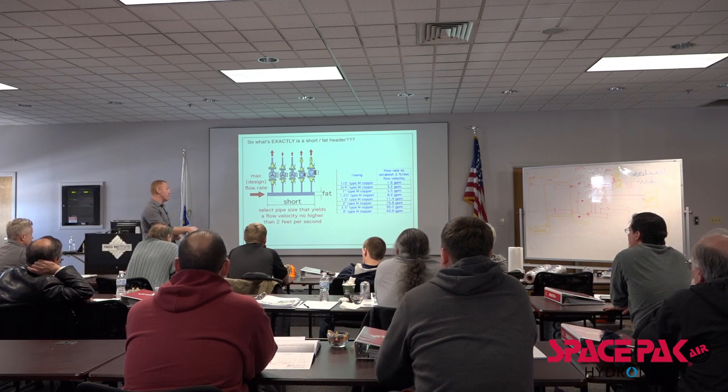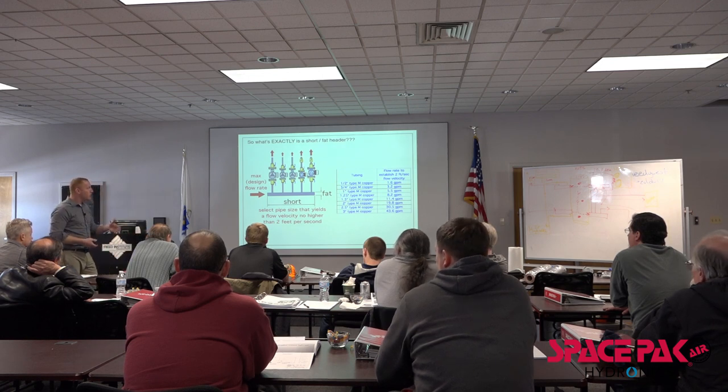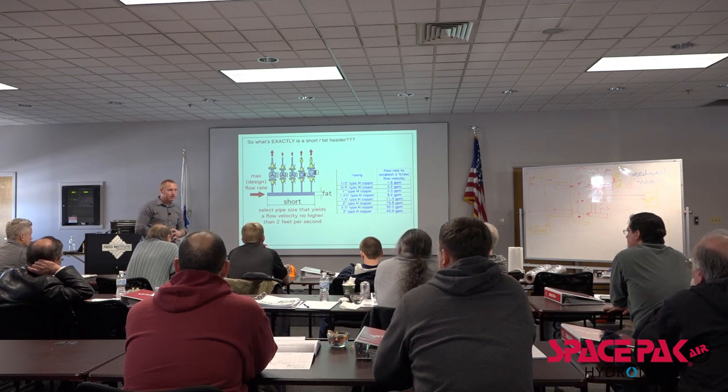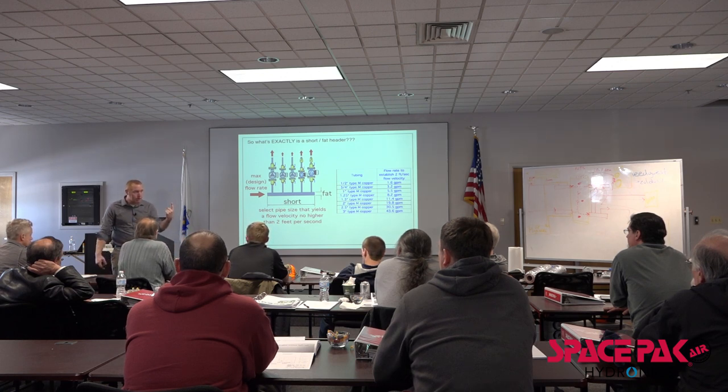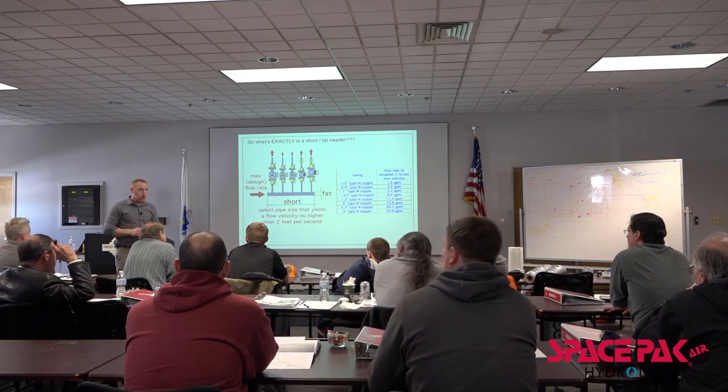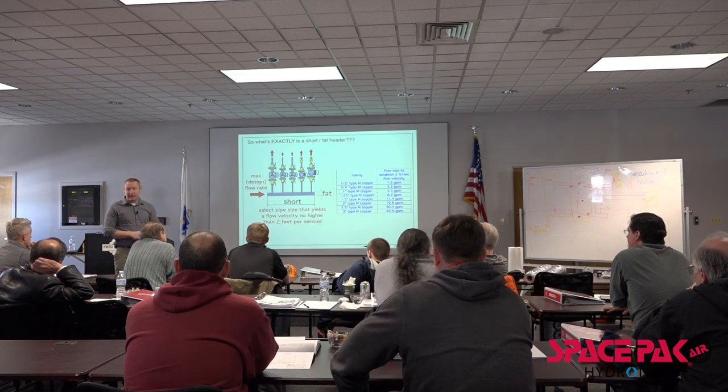Generally speaking, that doesn't mean I'm going to go up to 2.5-inch copper. From a sizing standpoint, and anybody that's been in the business long enough, a lot of inside and outside sales people that help contractors lay things out, you basically design for usually 60 to 70% of full load, or 60% of the whole system calling at one time. Really the only time your system is going to call 100% is on startup, or if it has been off due to a power outage, and then all air handlers are going to come on. And keep in mind, even though the air handler may say it's 60,000 BTUs, that doesn't mean it's going to draw 60,000 BTUs the second it comes on. It's contingent upon our incoming and outgoing air, right?